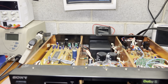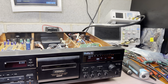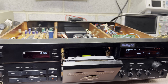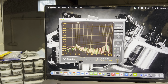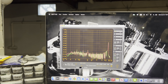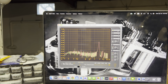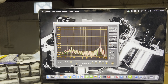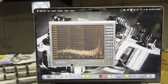You may check one more time if it will still perform well. Let's throw the chrome tape back. This should be 400 Hz to 15 kHz. See - 15 kHz again, then 400 Hz, 4, 5, 10 - see, no change in the levels. It goes pretty smoothly and even between left and right channel.